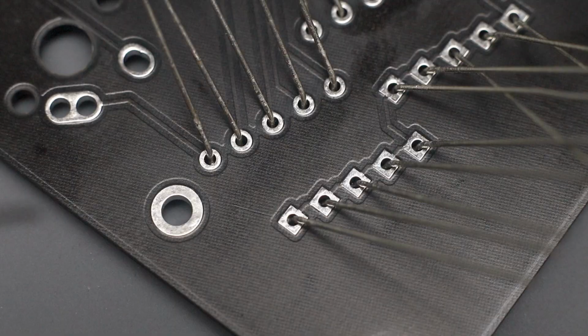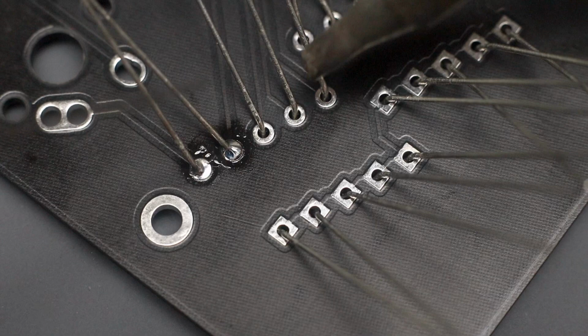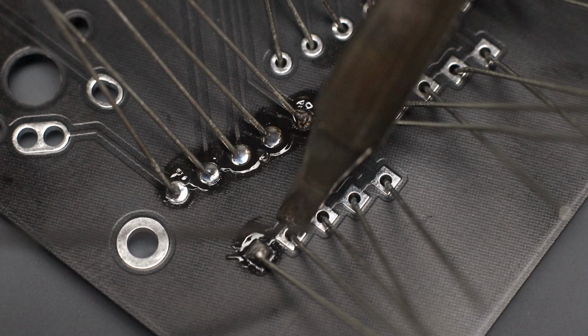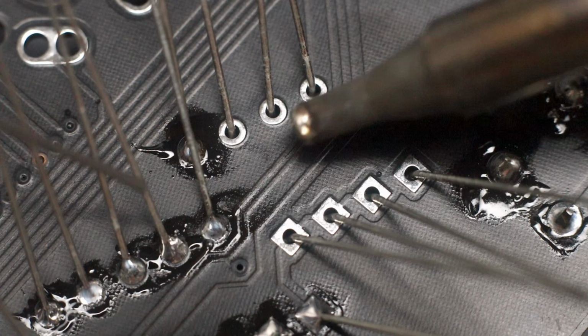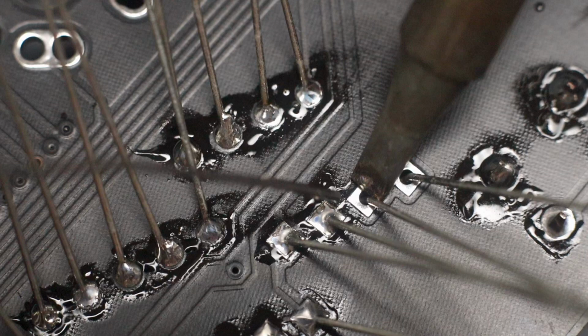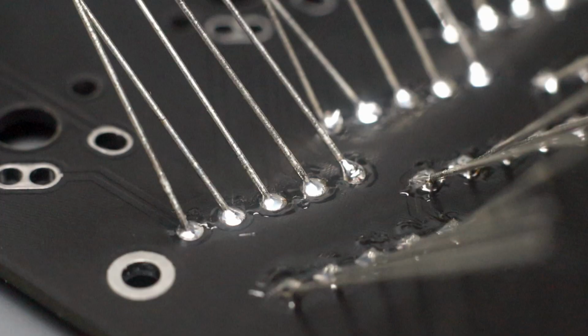By this time, we should have gotten our groove in terms of soldering components. So soldering all these diodes should now be a breeze. Just a reminder: soldering iron in, apply solder, solder out, soldering iron out.